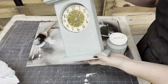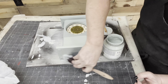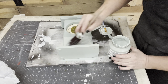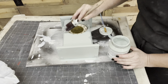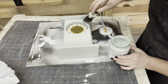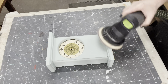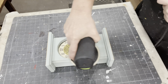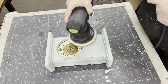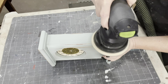Some Fusion colors you're lucky enough, like the black, to maybe have a one coat coverage, but most of the time it's a two coat coverage. That second coat just goes on amazingly - it's like the first coat is there and then it attracts that second coat to really get on there. Now that my second coat is dry - and yes I did do the back - I'm going to go ahead with some sandpaper and distress it. I don't mind if that burgundy comes through at all; I want some of the wood to come through, but some of the burgundy will match that transfer I'm going to be using.